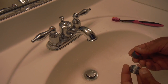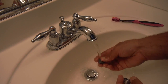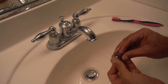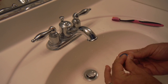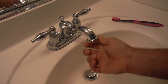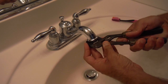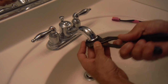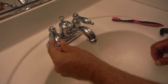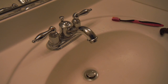Now that it's soaked for a little bit and the screen is pretty cleaned up, we'll go ahead and rinse it off, make sure all of that debris is out of there, and then reassemble it — just snap it back into the outer ring. And that's threaded, so you just put that up underneath the faucet and screw it in. We'll use the channel locks to make sure it's snug and doesn't fall out. And the water comes out a lot better. That's it, you're all set. Thanks for watching and good luck.